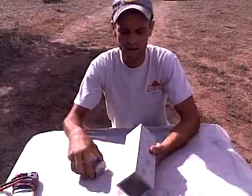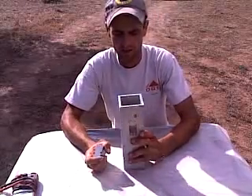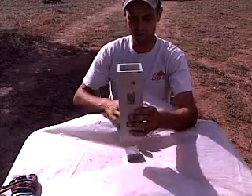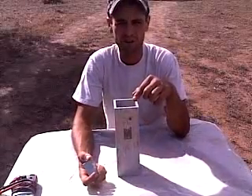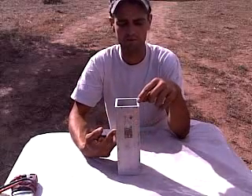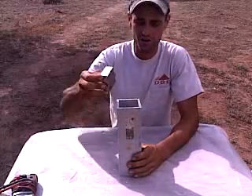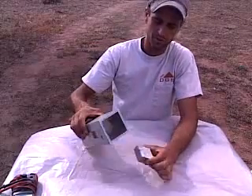It's basically in the shape of a coil. When you move a magnet past a conductor coil you generate electricity. What's happening — say I'll drop that magnet down the center of it — you'll notice how long that took to come out. As it's falling, the motion of the magnet going by the conductor is creating electricity, which in return is turning this into an electromagnetic coil — a big electromagnet — being charged by the motion of that magnet falling.